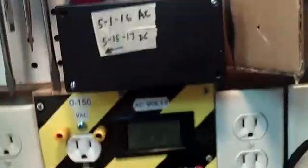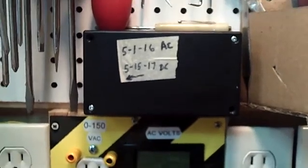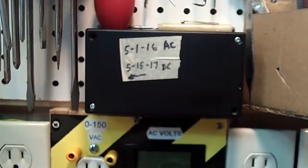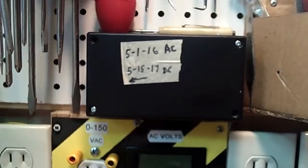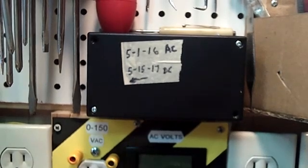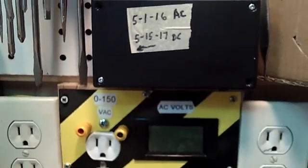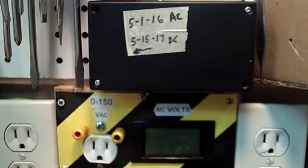So those will be cheap and easy ways. The only thing I'm worried about really is over voltage, because when you get them out of the pack and plug them in, they'll put out quite a bit more than 9 volts. And I tried to find the regulated ones, but they're a lot more expensive. So I figure, if nothing else, I should have some 12-volt regulators and put that on. These meters will work up to 12 volts, and I'm sure a little lower won't hurt them either. But at 12 volts, they should work fine.